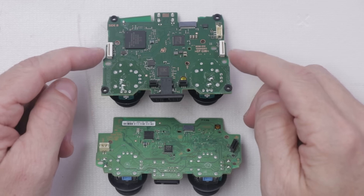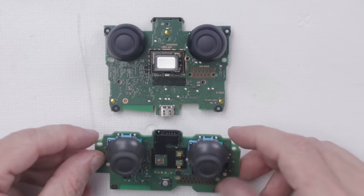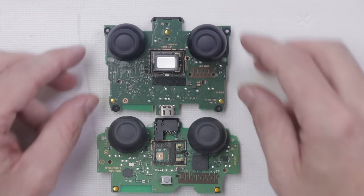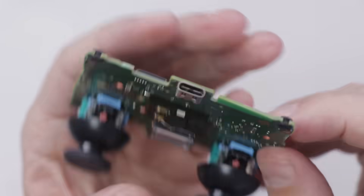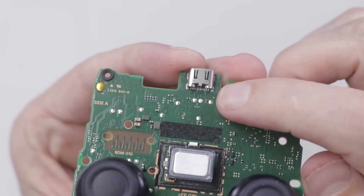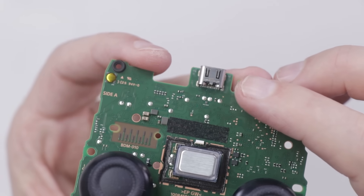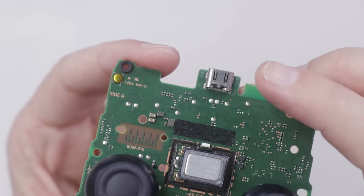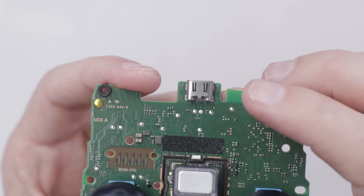So here we have the motherboard for the DualSense controller and the DualShock 4. The main thing I'm looking for is the differences in the analog sticks and any other noticeable things on each of these motherboards. Let's take a look at this charge port — there are four large mounting pins and then all of the small pins on the back. That's pretty typical for a motherboard like this, and it's actually fairly easy to replace these using hot air to drop the port out and put a new port in. While I do expect a lot of these to go bad, it's not a problem for anyone who knows how to micro and hot air solder.